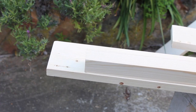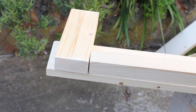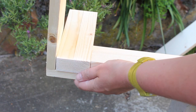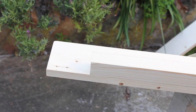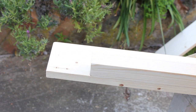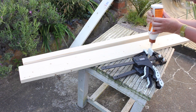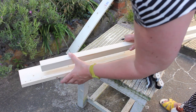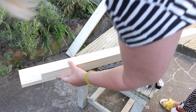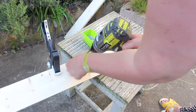You're going to put a frame together: a long plank, a long square piece, a leg, and a side piece — it's going to look sort of like this. Then take the leg and side piece away, and mark where the long square piece ends. In between the two marks you just made, apply wood glue to keep the long piece in place. Place it on top and use some clamps to keep it in place, then screw these two pieces together with the pre-drilled holes you already made.